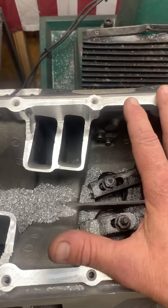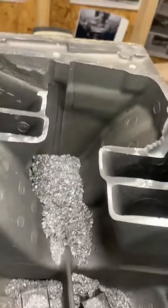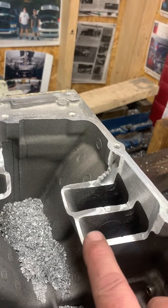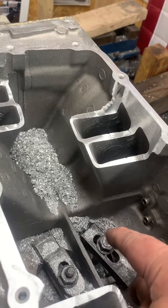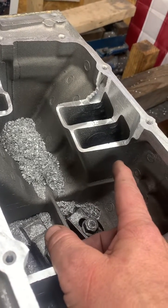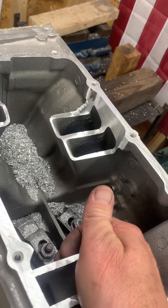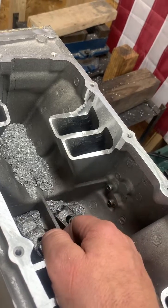This is my preferred way to do a starting stage one for a RAM heavy torque setup. Can you do more? Absolutely. You can bring it down to 11 inches all the way across, drop the floor even further, still be under 2500 cc's of intake volume, and get a 13-inch runner with about 10 to 15 more horsepower on the same camshaft. But you're going to lose 10 to 15 lb-ft of torque while gaining the horsepower and RPM. If you're after horsepower, that's the way to go.